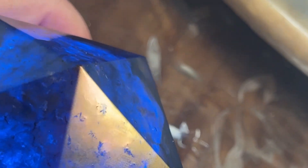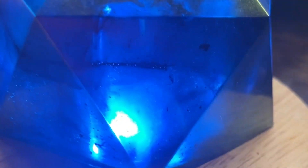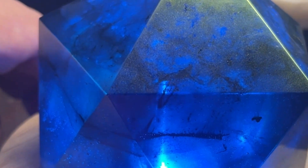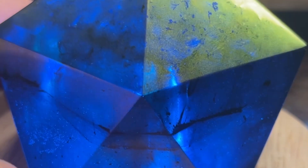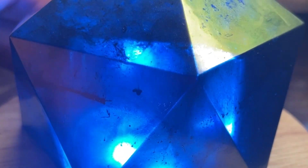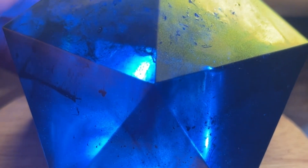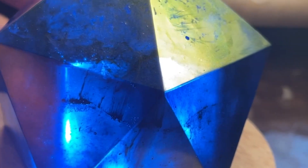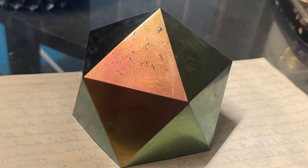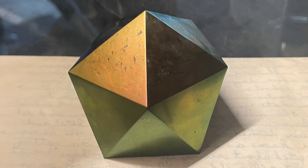You see the dimpling at the top — that's because I put the quartz crystals into the resin while it was in the silicone I had dusted. The quartz crystals basically just poked holes in the visual; it didn't hurt the silicone or the outcome, but it did break the mirror facade of the top. So be aware of that if you're doing a technique where you dust a mold and also add crystals or anything pokey like paper — it could break the visual of the dusted mold.